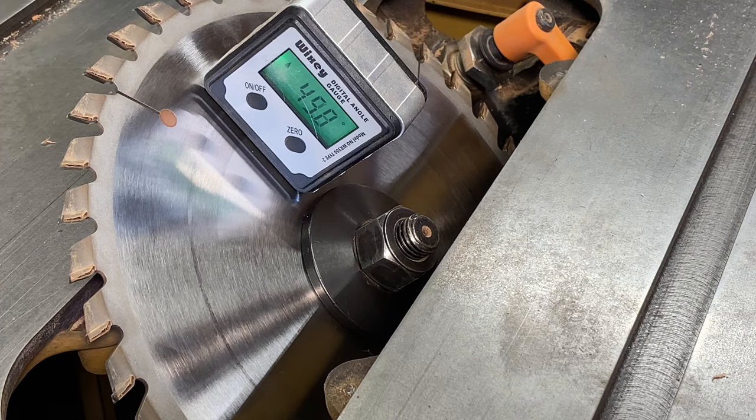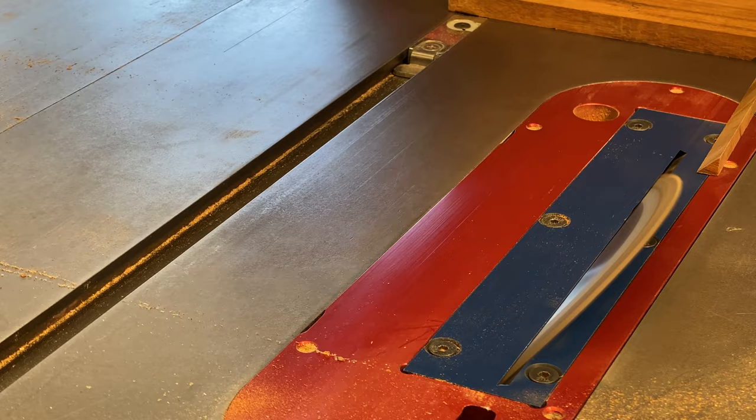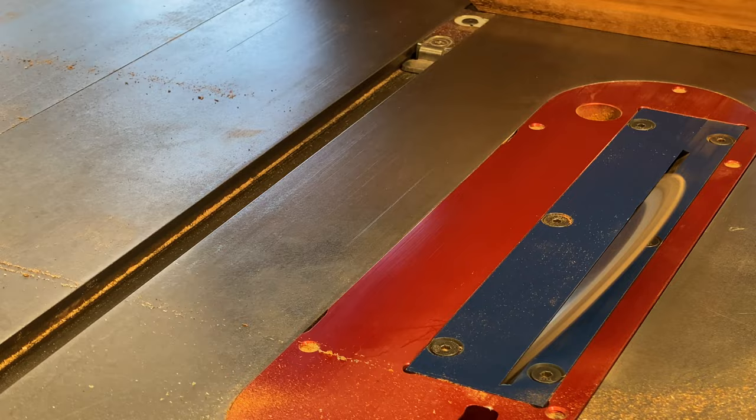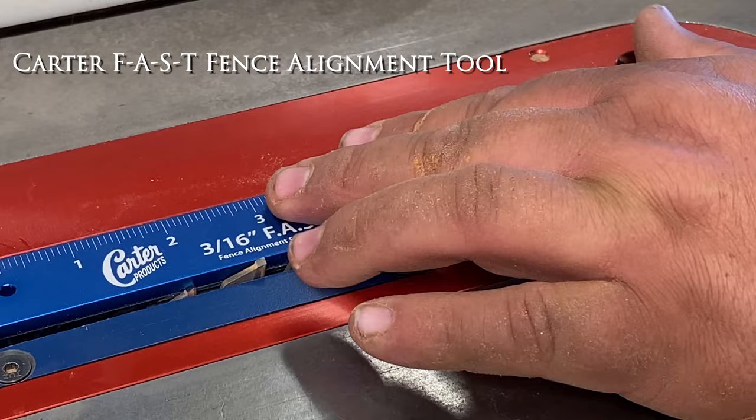So I nibble away at 45 degrees until the blade just kisses the topside edge. I want to retain as much wood as possible so I don't screw up the continuity. Just make sure to use your stop block so your sides are the same length. I use this to set the blade height to cut grooves into the box sides to insert the floating top and bottom.